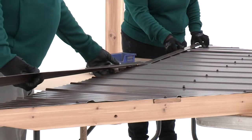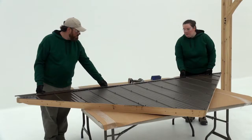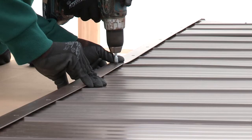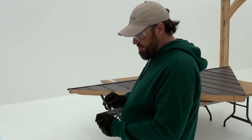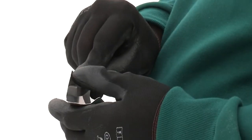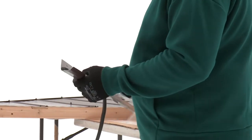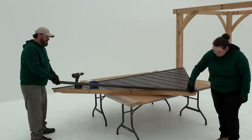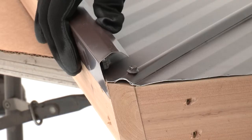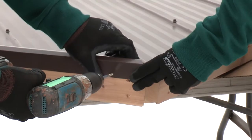With a helper, place a roof edge left and roof edge right along the bottom of each roof rafter assembly so that they meet in the center and the ends are flush with the ends of the fascia beam assembly. Attach with roofing screws. Now peel away a small portion of the backing on a strip of weather seal, then begin attaching it to the rounded bottom of a ridge clip. When you're done applying the full length of weather seal, attach the ridge clip to one side of the roof panel assembly. Take care not to push down on the ridge clip as you attach it with wood screws.